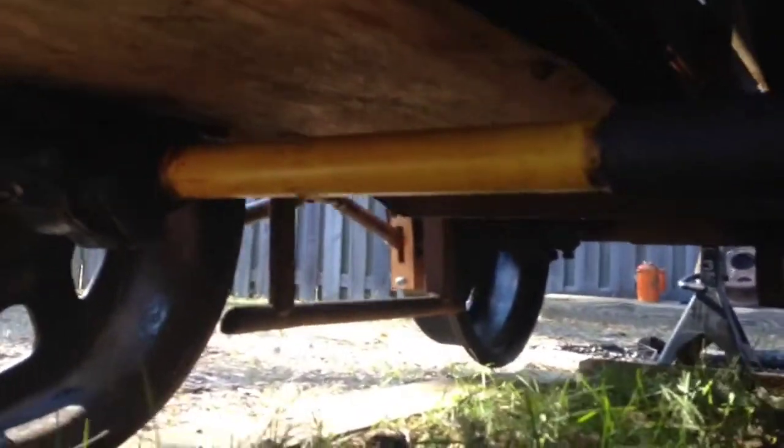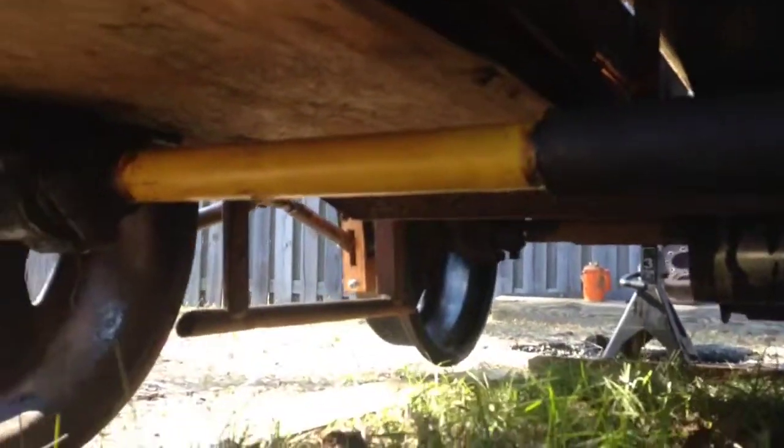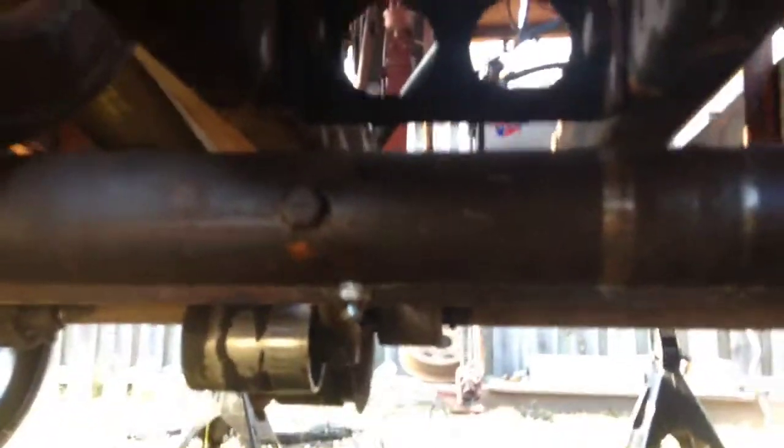Had to put a new axle half on the right side front, split axle, that was bent. Installed grease fittings where there were oil cups to better lubricate the car all the way around. Where there were any oil cups, I installed grease fittings.